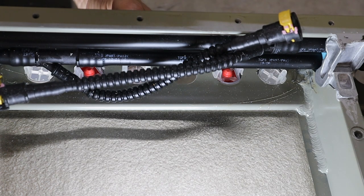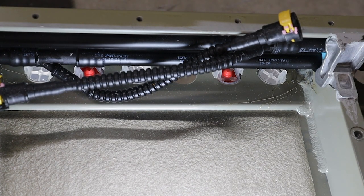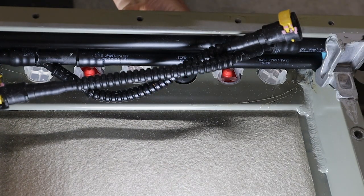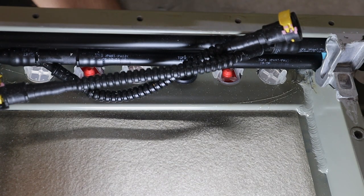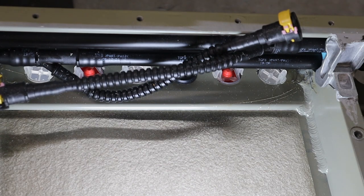I'm still going to need to pressure test the battery pack. So what I'm going to do is leave that Gore-Tex air valve off to the side and instead just install a rubber plug — a one-inch or 26-millimeter silicone rubber plug — just to momentarily fill the gap, because the Gore-Tex breather valve would just allow air to come right out and I couldn't pressure test it.